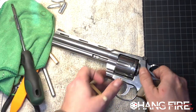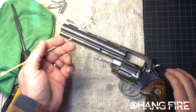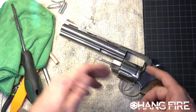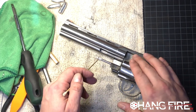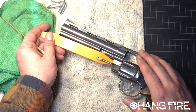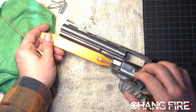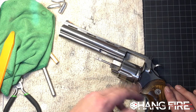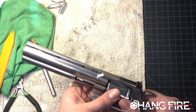Let's talk about some of the things that are bad. I know this is somewhat inconsequential on this particular gun, but we don't have any forward locking — it only locks at the back of the star, and we'll get into that. One of the things that really does bother me is we've got a little bit of wobbly runout here. You can see it in the camera — probably 20 to 30 thou of runout. Again, inconsequential since it only operates the ejector, but it's there.